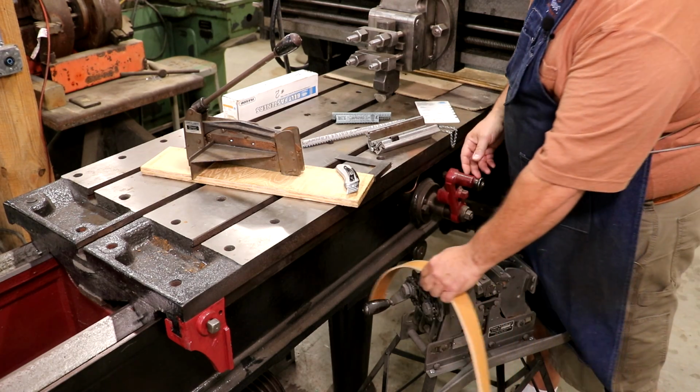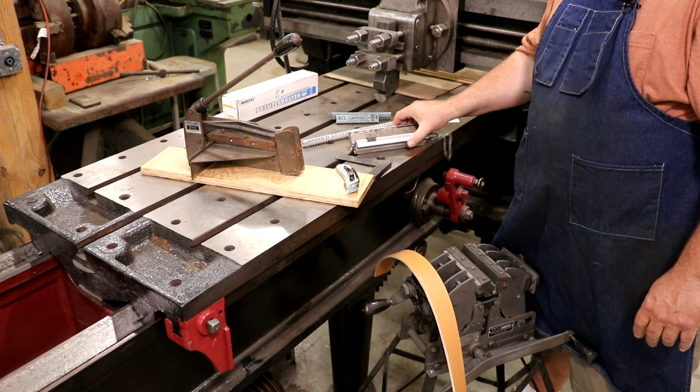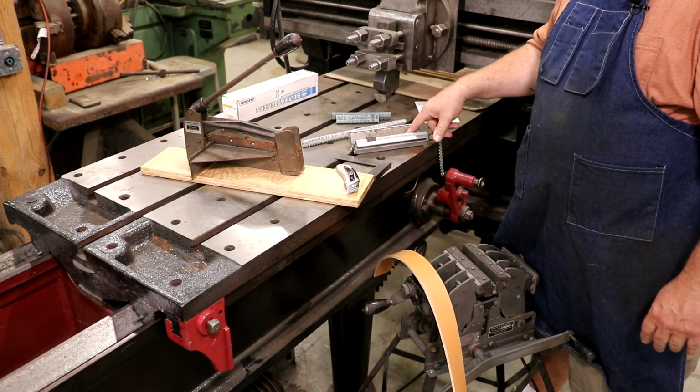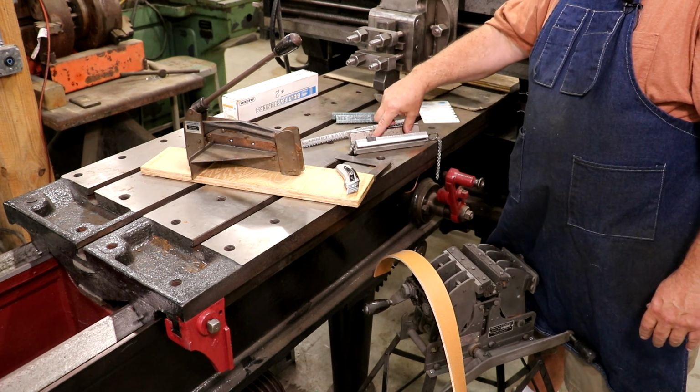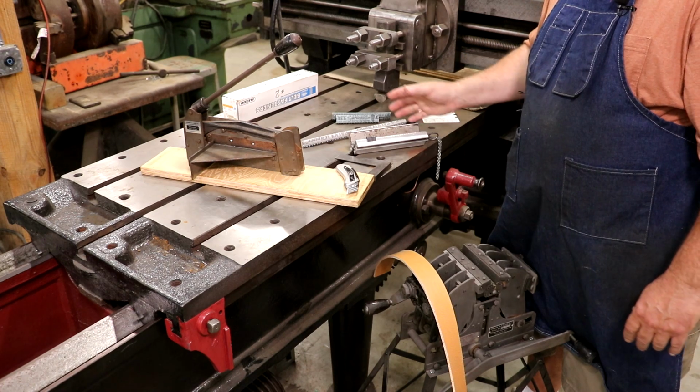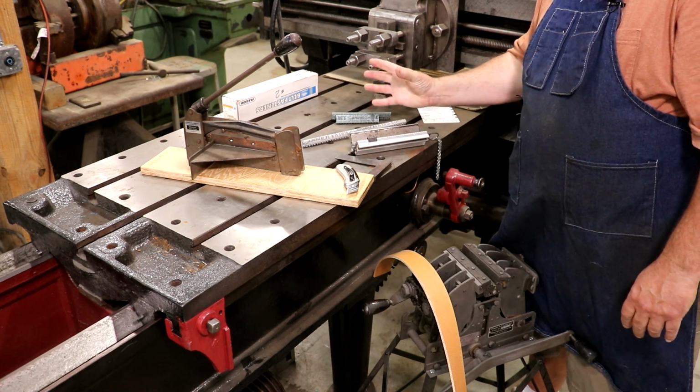You need a lacing tool to actually crimp the parts. This is one that fits in a vise. You can put it in your toolbox and pull it out whenever you need it. You put the lacing down in the comb, I'll show you this in a minute, and then you can just use your vise to squeeze it shut, and it clamps those clamps together.